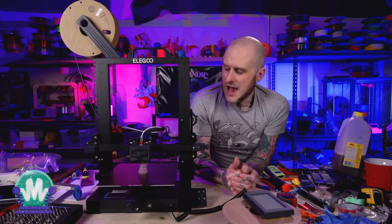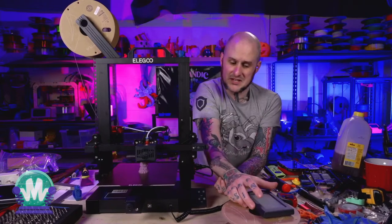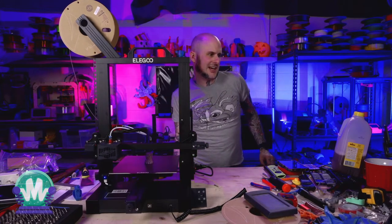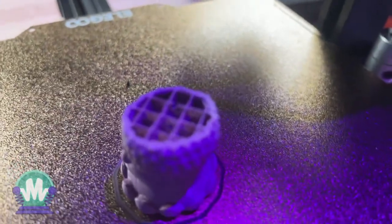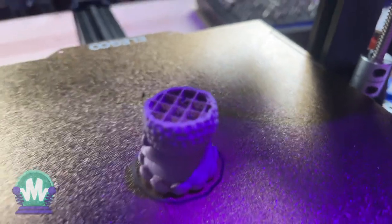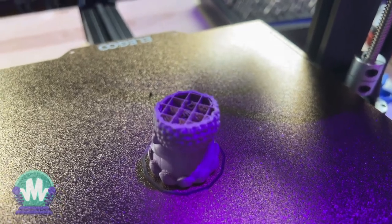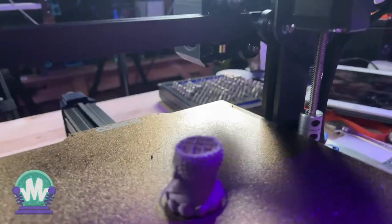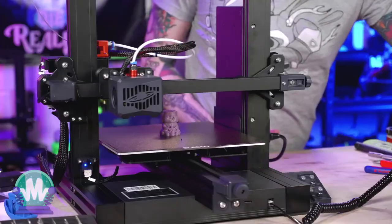I mean, we're still going. I'm gonna pause this real quick. I wanna show you folks the under extrusion of the test bottle. Yeah, my desk is a mess. Alright, I'm going to show you the under extrusion in the infill real quick. Focus. See it there? Yeah, so infill, pretty under extruded. It's definitely not keeping up there. But otherwise, I can't get a good image of this, it's too close. But anyway, otherwise, we're looking all right. Let's see how it resumes from that.